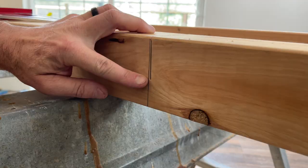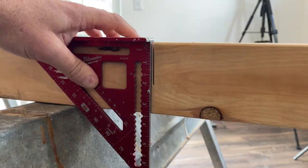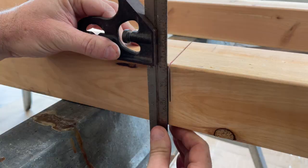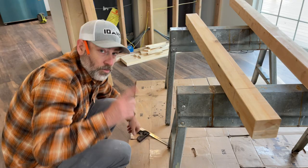We're not cutting square. Either the square has been bent or the saw is off. Yeah, that's not good. Because look at it right here, see right there. It's not like it's a really big deal, but it would be good to have it either cutting right or get rid of the square. So we'll check it with this square. The two squares agree, we'll check one more square.